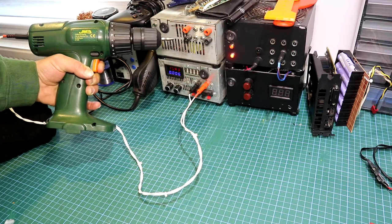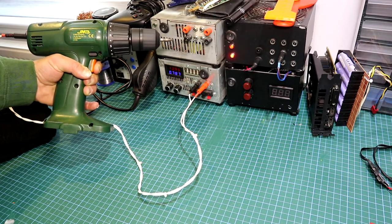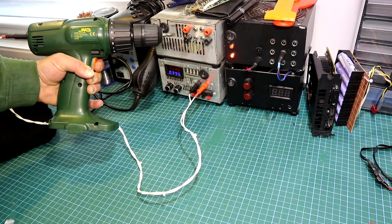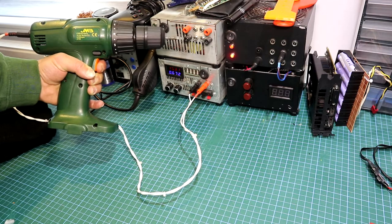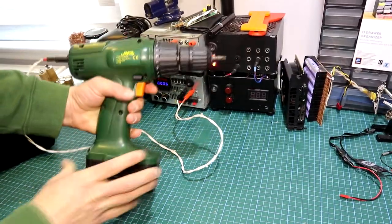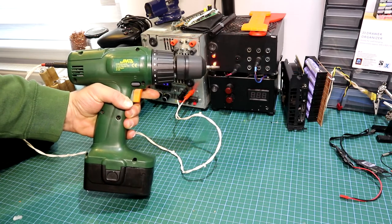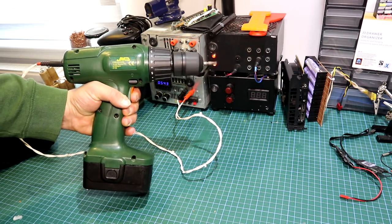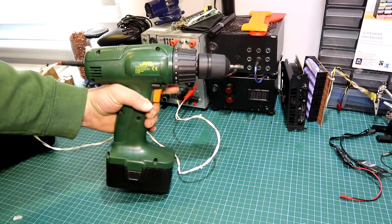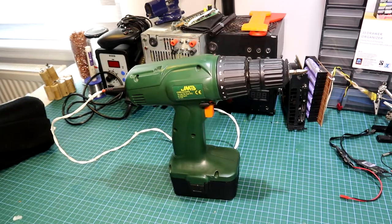The drill is working just fine but my bench power supply seems it can't keep up with it. Because of the inrush current at the start of the motor, a very large current is required due to the motor coil having a very low resistance. That's the reason I'm keeping the battery in the first place — it acts as a buffer for the inrush, kind of like a big capacitor. The battery can be used while it's getting charged, like I said.